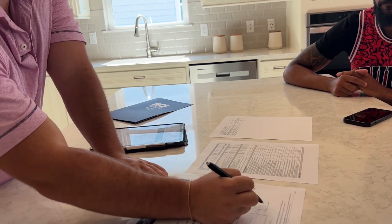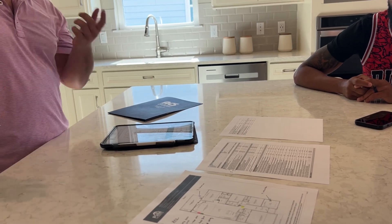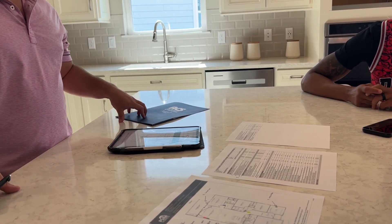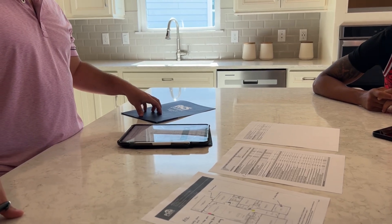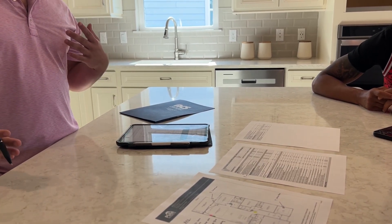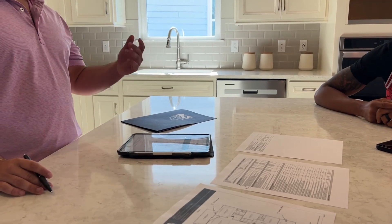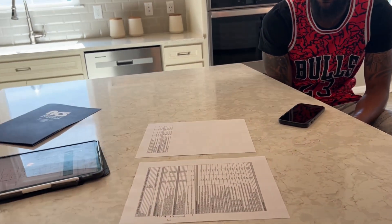You can put the recorder in your main office hub and HDMI it to a monitor, and it'll also have an app so you can airplay it to a TV. If you're going to stay for 10 years, paying $10 a month on a cloud-based service actually makes it more cost efficient to pay more upfront for an NVR. Also, research Wi-Fi cameras — if you have to change batteries every six months you're climbing a ladder repeatedly. Hardwired avoids that.